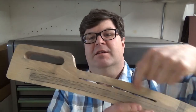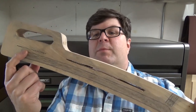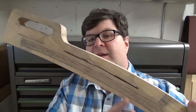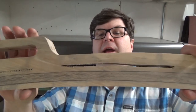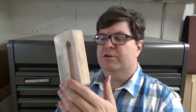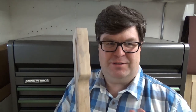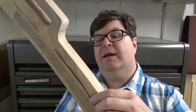I'm in the process of cutting the slots for the handle. These two things will be the slots to accept the weave, and then there needs to be a channel about 20 millimeters deep to accommodate the folding mechanism. But it's just not going well — I really butchered this on the jigsaw. Part of the problem is this is hardwood — it's birch, yellow birch, and it's pretty hard. It's also thick, 32 millimeters, about an inch and a half, which is really pushing the limits of what a jigsaw can do. I just fought the thing the whole time trying to keep it on track and lost the battle.